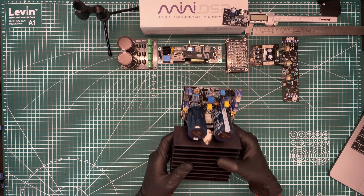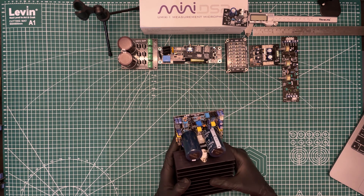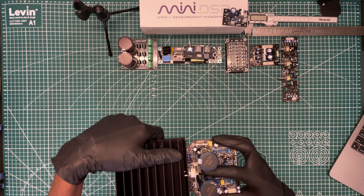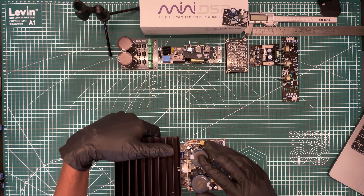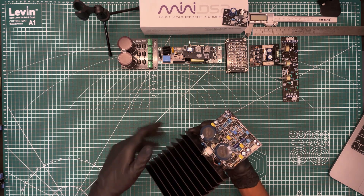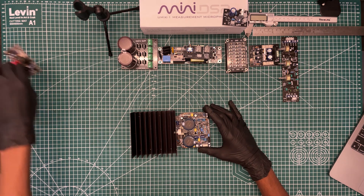One of the most beautiful amps I have ever seen — made by hand, so spectacular. The input for this is completely different. There is a four-pin plug: one is dummy, we use three. That is where we provide AC input — 30-0-30 AC goes in here and it has the rectification and power supply section built into it. There's a bridge rectifier right below, and two capacitors each of 63 volts 10,000 microfarad, which is more than sufficient to power this beefy amp.